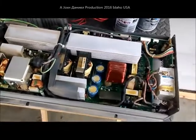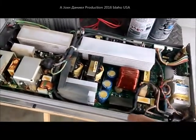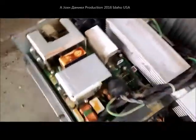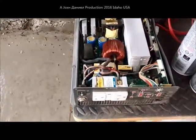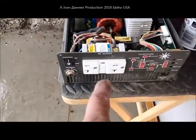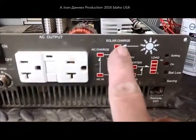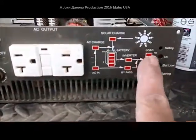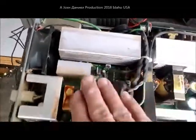It's true sine wave — you can see that by the big toroid. It's got multiple toroids in it and it uses multiple-strand transformers. It comes with GFCIs, solar charge input right here, AC charge, and it'll switch back and forth. So I can have it plugged in, and it has about a 5 or 10-amp battery charger built in.